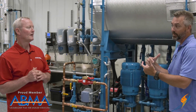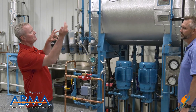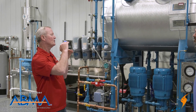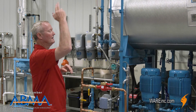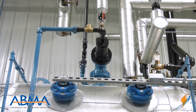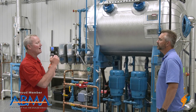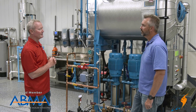Now, it sounds simple to say, but what is it actually doing to get the oxygen out? What it's doing is actually called stripping. You have steam coming in, and that is shooting through the makeup water, which breaks those oxygen molecules up, kicks them out to the top, and then there's a vent that goes outside — so it's continuously venting to the atmosphere. There's a valve up on top — a three-quarter inch valve on this particular one. The gate in that valve has a hole drilled in it, sized for this tank, that allows that oxygen vapor to go out continuously, emitting those vapors and getting them out of the water.